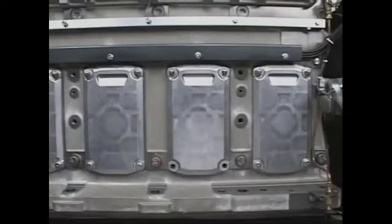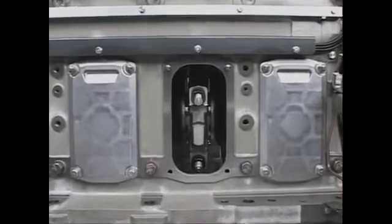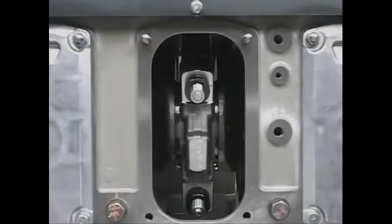I'll explain the measuring procedure of crankshaft deflection when overhauling the main bearing, or when running the engine every 2,000 to 2,500 hours. If the crankshaft deflection is excessive, the crankshaft may break and result in an accident. Consequently, periodically measure the crankshaft deflection, and make sure to measure it when the engine is cool.